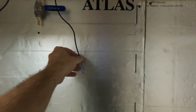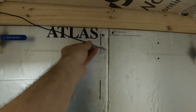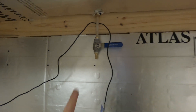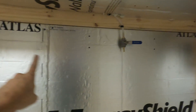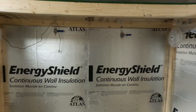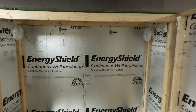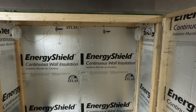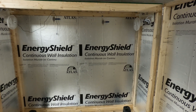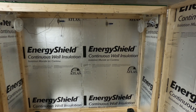This is the temperature probe — it will mount up here in the center just to get a reference of the temperature to turn the thermostat on and off. The vacuum line comes inside the box and runs to two separate ball valves here. I can hook up to pull vacuum on the parts. I can use one or both of these depending on how large the part is, and shut off the one I don't need.